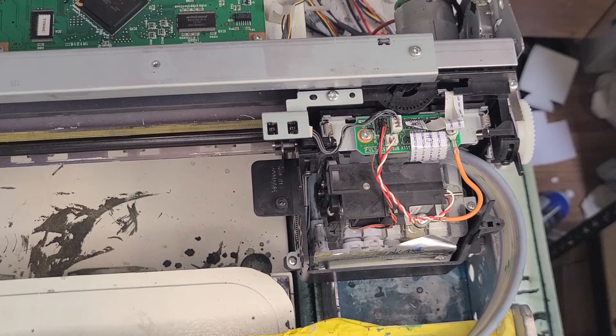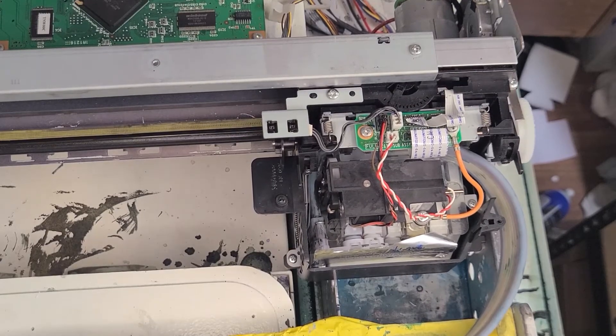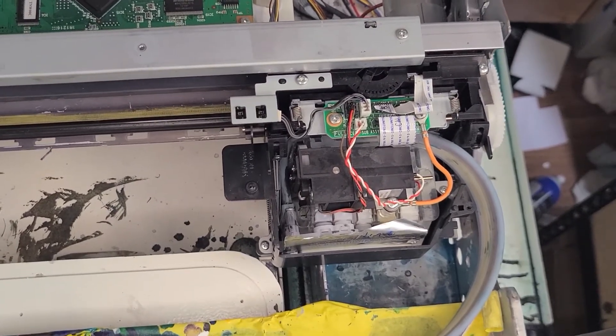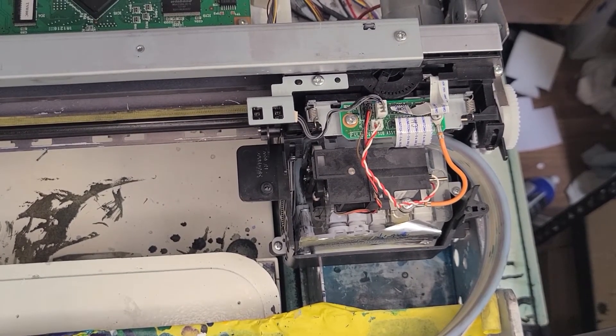So that is how you remove the damper station, inline kit, and access the printhead to clean, flush it out, or remove it. Sometimes I do remove them — I think it is healthy to remove them and soak them, just a standard process for cleaning and maintenance. Maybe once a week, or depending on how often you print, they can get gummed up pretty well. This is the startup sequence it's going through right now — it's kind of priming the ink lines and we are on and ready to party. So if you found this video helpful, hit the like button, subscribe to the channel. I make all kinds of content revolving around DTG, stocks, funny videos, podcast videos, all kinds of stuff. Drop a comment below and let me know what you need to know and I'll do my best to answer those questions and provide you a nice visual to help you along the way. Till next time.